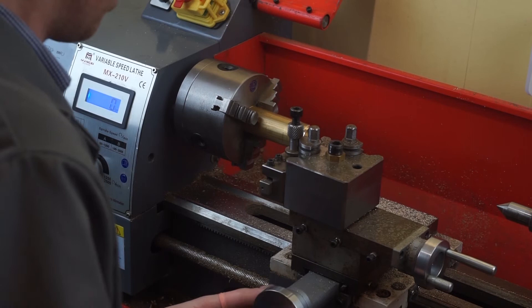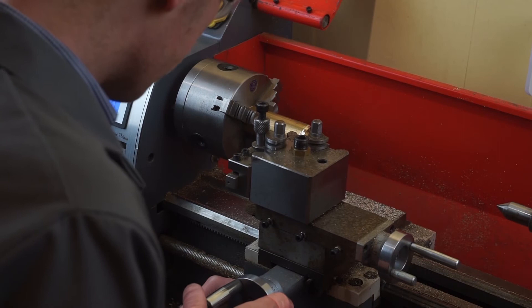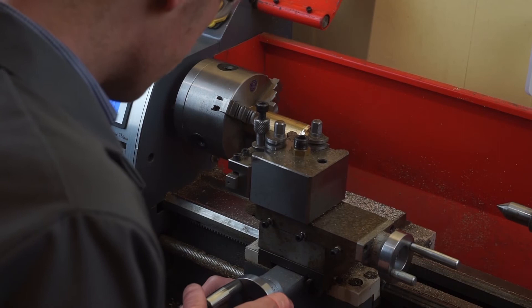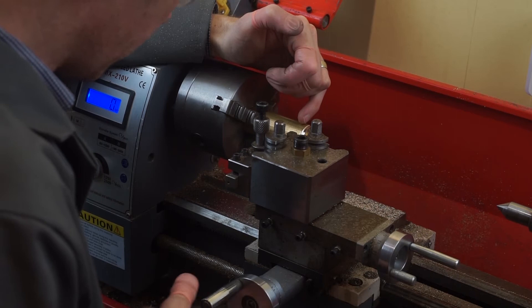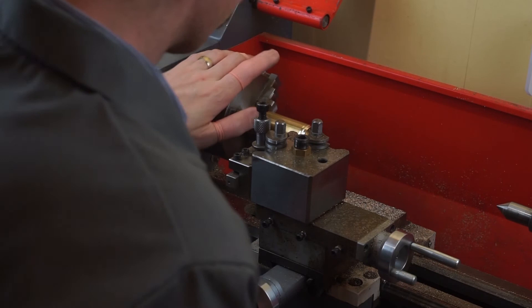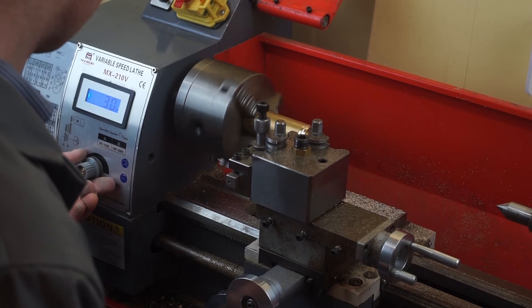Quite often I'll be changing tooling over and making adjustments as I go. I've got a line that I've pre-scored in here, which extends to the complete height of the movement ring, which is 4.5 millimetres. I'm going to line the tool up and turn the chuck by hand just to make my first impression, to make sure that everything's going to be okay. With parting I actually do a really slow cut — we're only going to be turning at 60 RPM. The speed on the other operations is not as critical as this, but when it comes to parting you really have to get the RPM right. That way I know exactly how quickly to feed in.